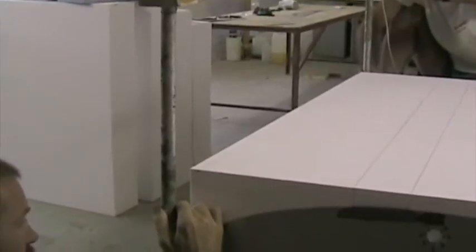Like that. Here's the position of template 5, which is the wingtip of the Express wing. This is a little piece we had to add to the leading edge at station 1 due to the fact that the block of foam was not quite big enough. But we've cut it out and bonded it in place. I'm ready to go on edge. Are you on? Yes, I'm at the edge.